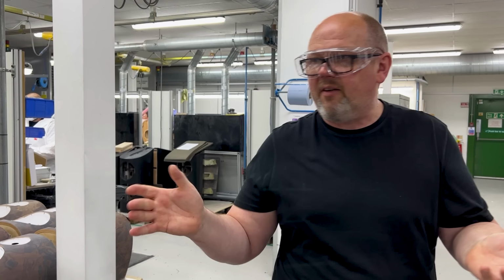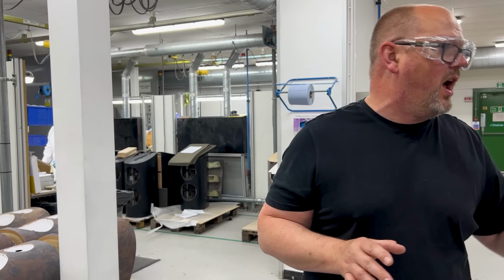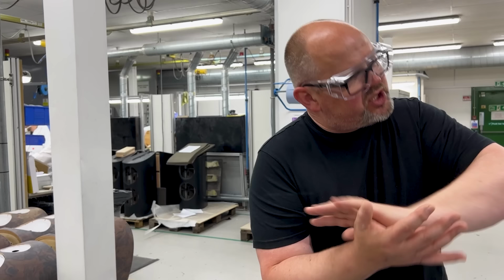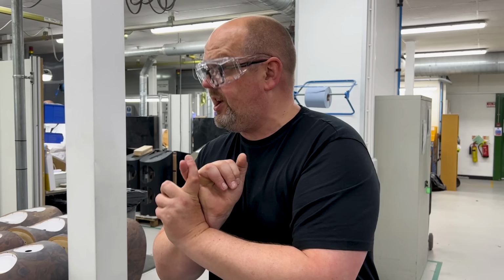So we'll come back in here for a second sanding process, and that will smooth them off. That smoothing surface finish gets them to a position where they can have a different type of top coat paint applied, which is thinner, and that top coat paint is what gives us that smooth finish. That will then dry matte. After a period of time, when it's ready to be polished, we can then machine polish it. So if you've got any form of gloss, which now means the midnight blue metallic and the black gloss, there's two sanding processes and a machine polishing process.